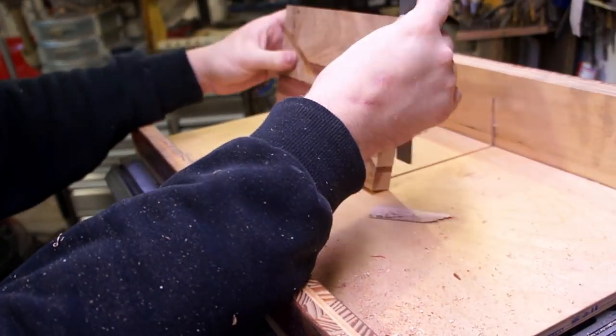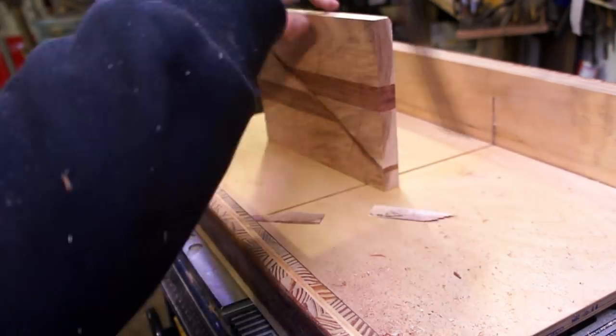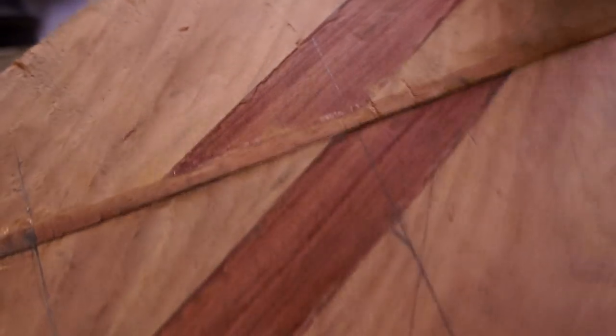Checking it with a square because it's going to become pretty critical as I lay things around the perimeter — everything needs to be at 90 degrees. This is a close look at the surface finish; it's amazing how much sanding this is going to take to make it exactly flush.